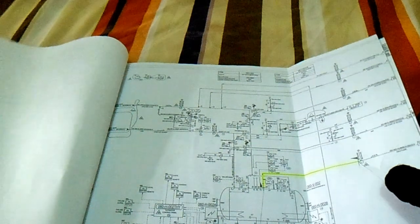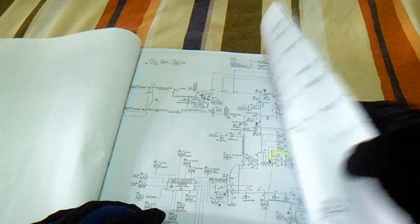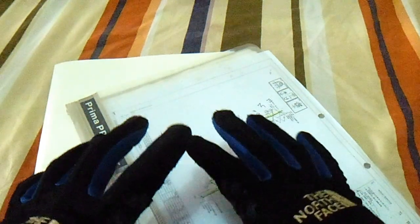All attachments shall be completed, like the isometric drawing, P&ID, and calibration certificate from the pressure gauge. Also the WIR — welding histories — and the punch list shall be completed from this test package to be satisfied. After all test documents are completed and all punch lists are completed, it must be signed by the contractor and the company for releasing for testing.